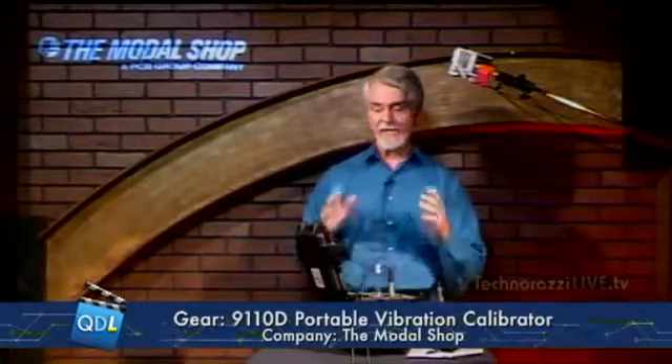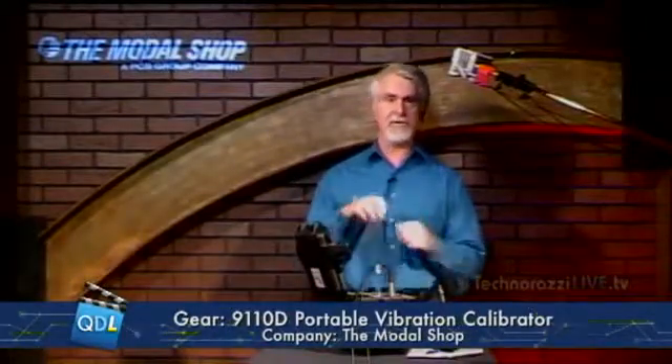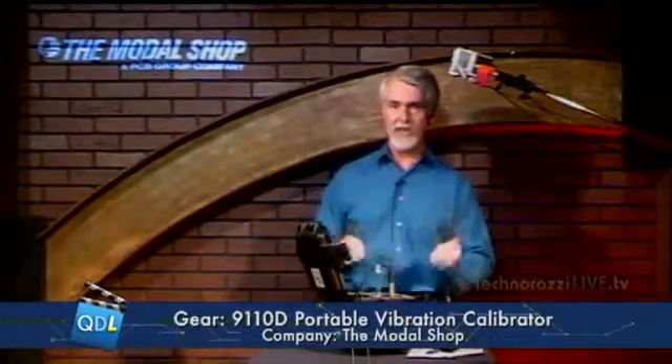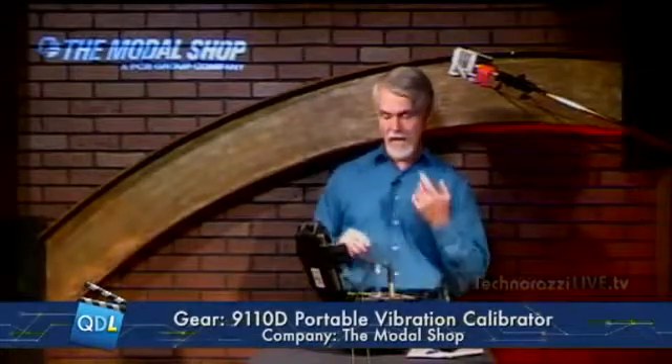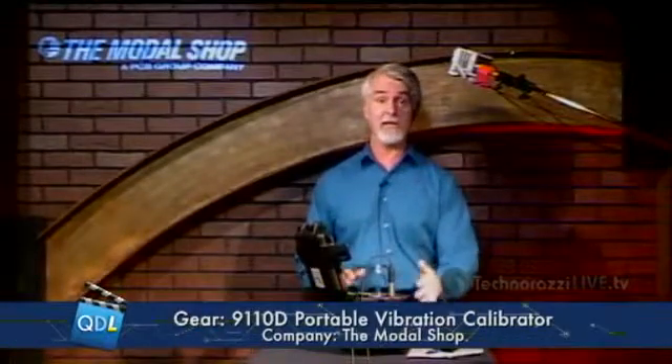By the way, this is battery operated — I'm running on battery right now — up to 18 hours operation on a charge. What's nice about that and why this was designed is you can take this out to the shop floor and do your calibration there. You no longer have to take your sensors out, send them out for calibration, wait for them to come back — meanwhile your machine is down, or you have to store a bunch of extra sensors. You simply take this out right to the shop floor, remove your sensor, calibrate it in a few minutes, and plug it back in, really helping reduce machine downtime. Once again this is the 9110 portable vibration calibrator from The Modal Shop — it isn't even on the market yet, we're one of the first to demo this, and thanks to The Modal Shop for sending it to us — it's due out next month.